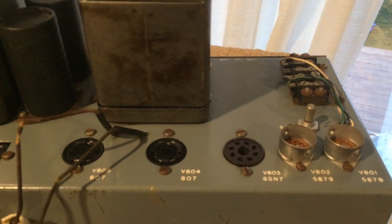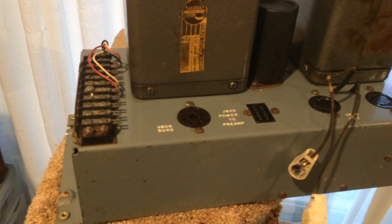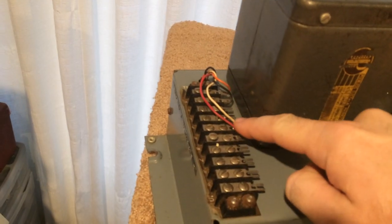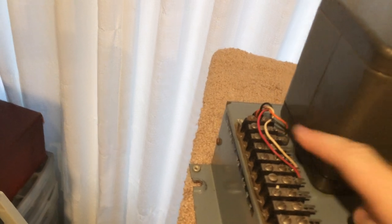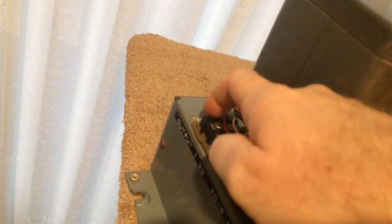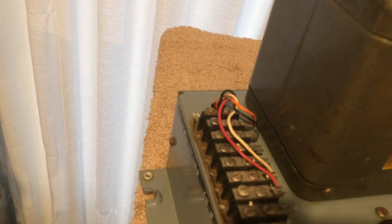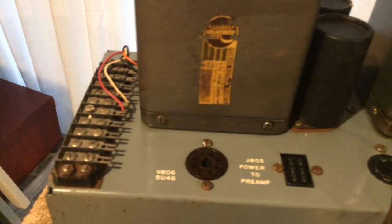This is a really old type amplifier, and if you have one or get one, you will not be able to just put it in your system and use it for home audio because none of its connectors are compatible with anything modern. Just look at this strip: these two wires are the power input — that's where the 120 volts came in — and those two are the speaker binding posts. They go into the chassis at the same place and are wound together, which is actually pretty bad practice and causes hum in the output.